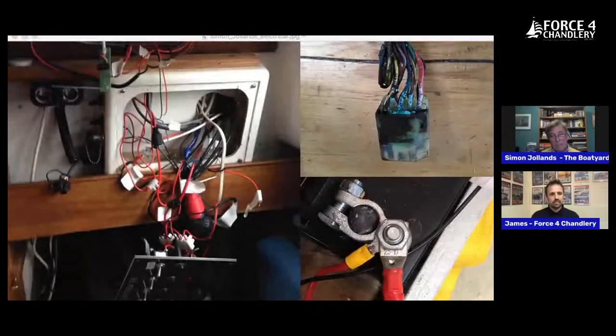Also wiring work — you need to check your wiring and make sure wires haven't been worn through by the motion of the boat. One winter I did a complete rewire with the help of a friend. We literally stripped the whole boat of all the old wiring — 40 years' worth, which was a complete mess. You come across bits of bare wire that are potentially very dangerous, could cause a fire, and will certainly account for equipment failure. You do need to allow quite a bit of time for a job like that, but it's very much worth the effort.